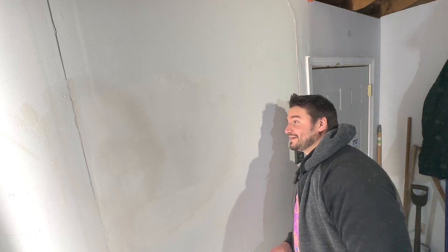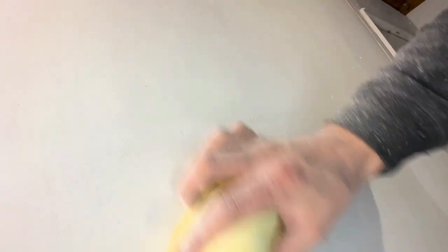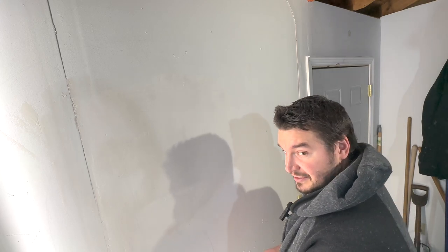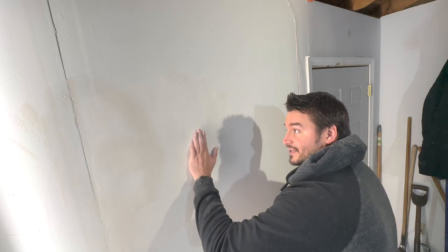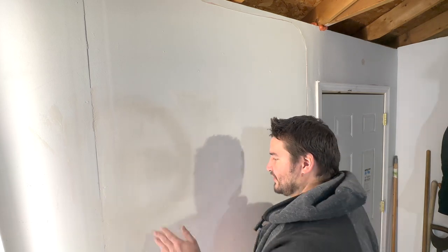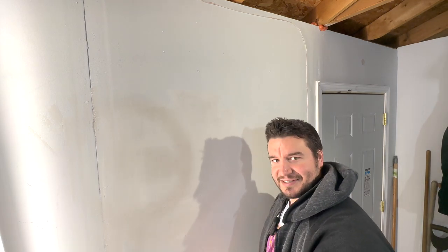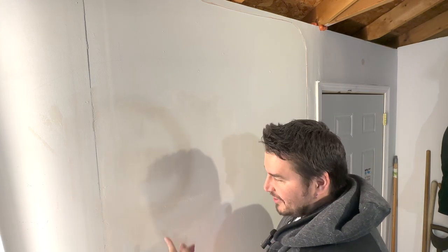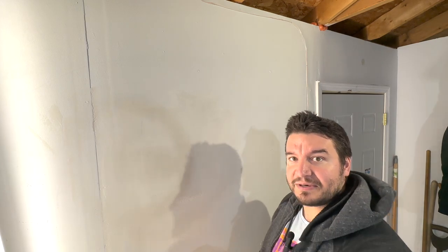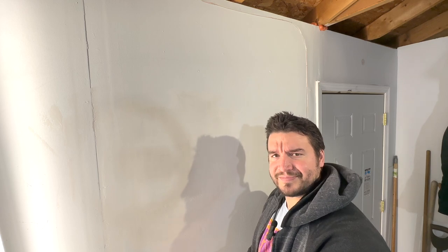If this were in the house I'd go another layer just to make it perfect. I sanded a little too much on the high spot of that hump, so I'd come back and put a little more mud right there. If you use the right size drywall, you should be fine — one coat maybe two. It's nice and smooth now. I'll probably do a third coat but won't put it in the video. I'll prime it; probably won't paint it since it's a garage. Let me know if you have any questions. I do have other DIY videos if you'd like to watch — thanks for watching, like and subscribe.